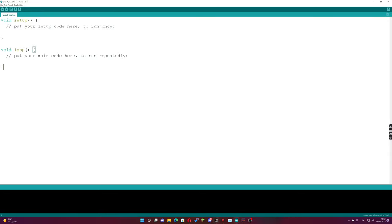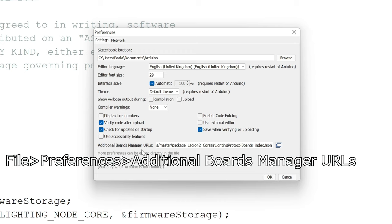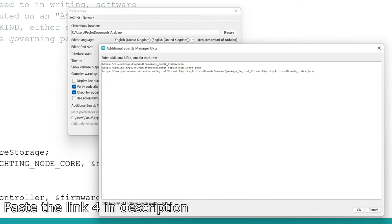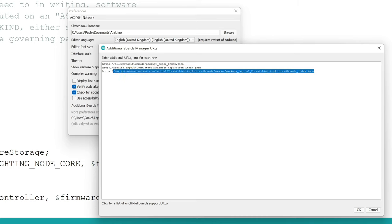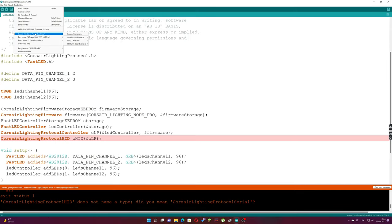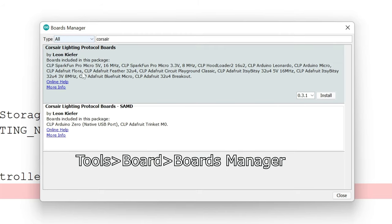After that, we have to install some extra boards. To do that, we go to File, Preferences, Additional Boards Manager. We paste this link that I leave in the description. To complete the installation of additional boards, we go to Tools, Board, Boards Manager, and we search for Corsair.